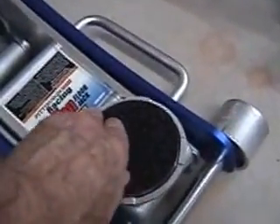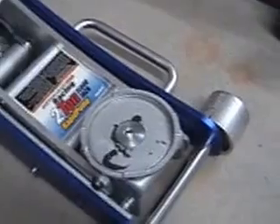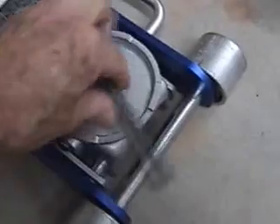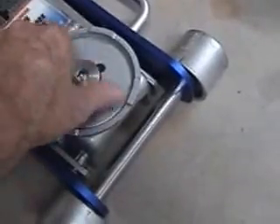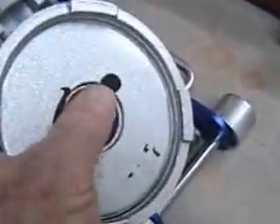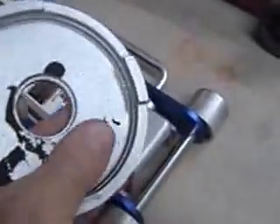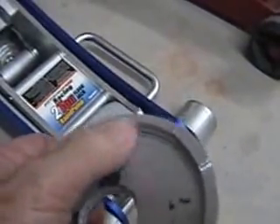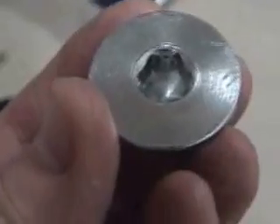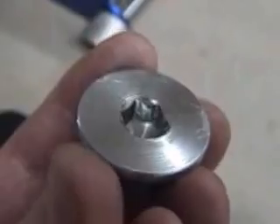In order to make this work, these are glued on — take that off, use a 10 millimeter, take this screw out. That's what makes it different from the other one; the other ones are just placed inside and this lifts right off. This is a quarter inch thick, and if you look at those steps, that's one eighth of an inch here and one eighth of an inch here, so total thickness is one quarter. Now if you add this ridge up here, that's another quarter inch, so I've got to compensate for that — maybe just lift the jack up a quarter inch and everything will be okay.